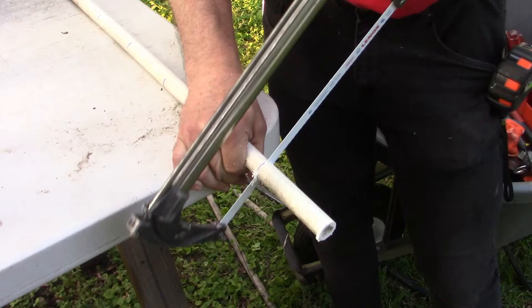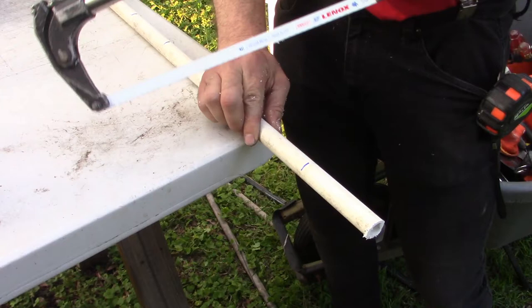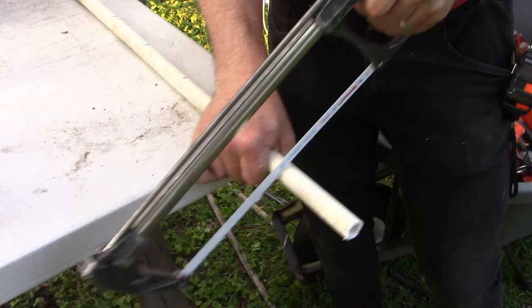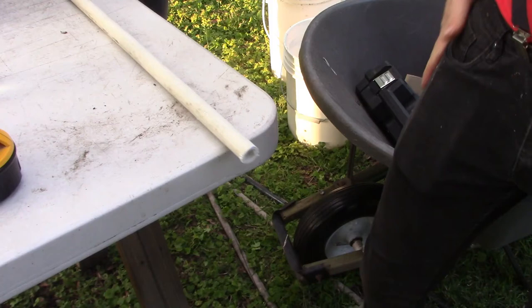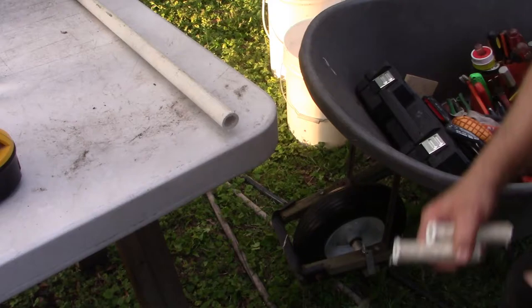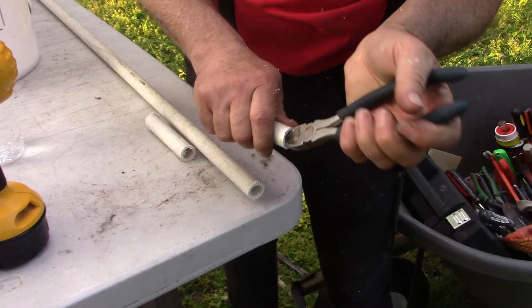The new blade makes it look easy. Once all the pieces are cut, the next step is cleaning out the ends — removing burrs. You can use sandpaper or a pair of dikes for the inside burrs, and sandpaper for the outside. I'm also going to taper the end a bit so it fits more easily into the grommet — that's the hardest part, getting it through.